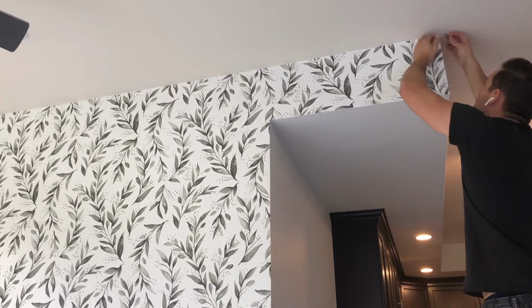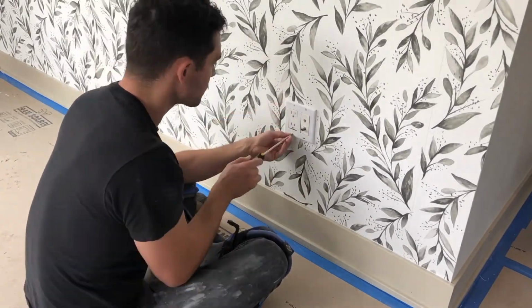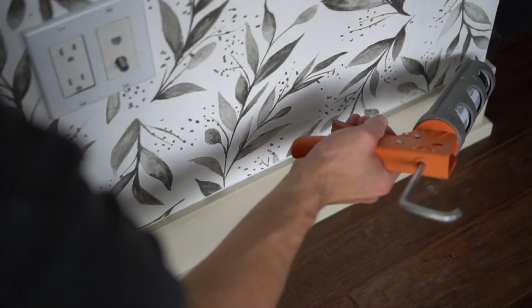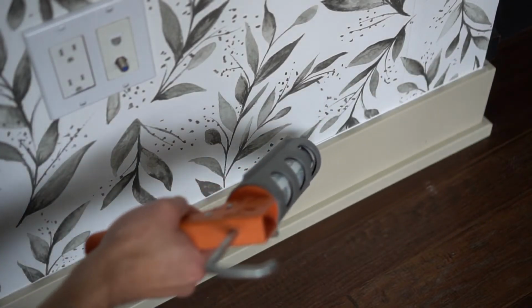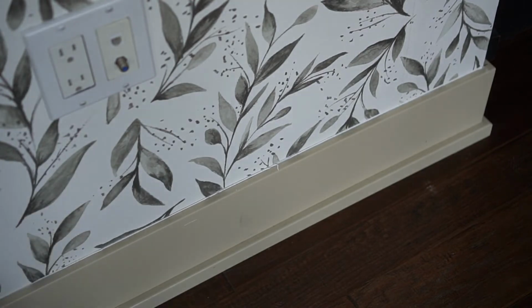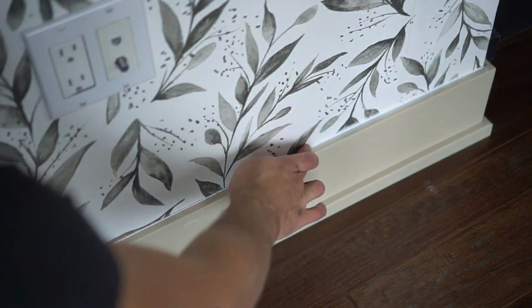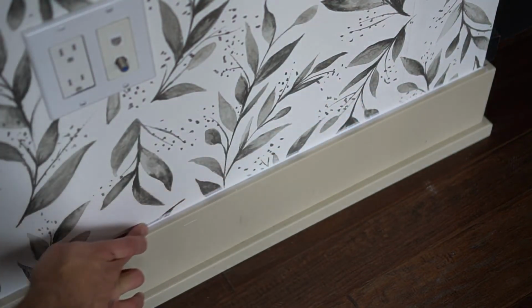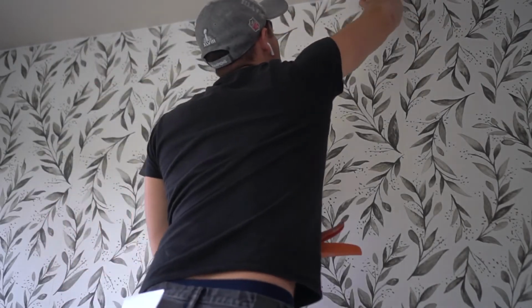As for the final finishing touches, go ahead and install your trim plates on all your electrical components, and what I do on all seams is actually caulk all the seams to the base or the adjacent wall that it's connected to. This just gives it a nice perfect seamless edge and adds just a bit more professional look to your entire project. And let's just say $6 tube of caulking that makes your job look better is always going to go down as a win in my book.